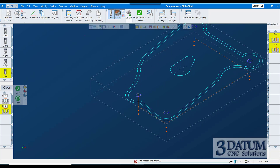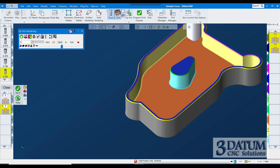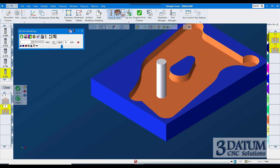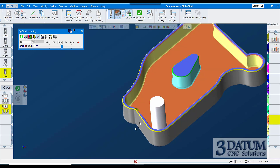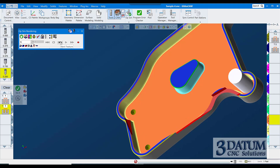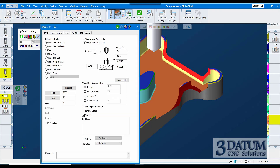All right, so I've got my toolpath now, but I'm about to crash the living daylights out of this thing — so let's watch. There's the tool. Here's the first hole doing it, getting there, and here it's going to just demolish it. So I don't want my clearance point — this value — being above the part, because then the drill cycle is going to start there.